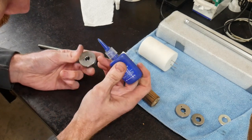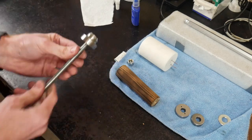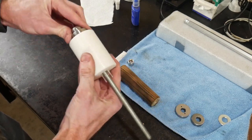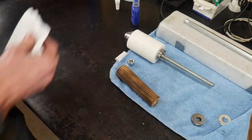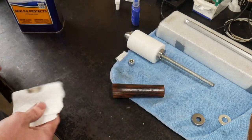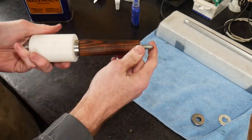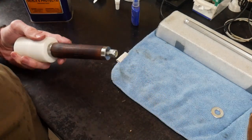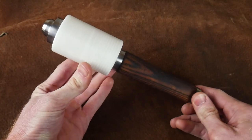We hit all the spacer material on the Scotch-Brite belt to give a satin finish — I use these belts on knives all the time and they're very handy here as well. I put some blue Loctite in the cap and start assembling the entire mallet, getting the nylon head located on top. Then the spacer goes under that. Before putting on the handle, I wiped it down with boiled linseed oil — this helps protect the handle, darkens it up quite a deal, and gives a better look. Then we slide the handle on, then the pommel spacer, and tighten the entire assembly up with the nylock nut.